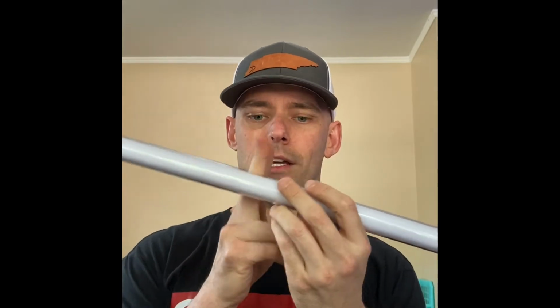It has the WS2812B strips in it. I also took the point in the middle where the manufacturer solders them together. I cut those, trimmed them down, and resoldered them so there's no dark spot in the middle whenever it's lit up. Got the blade side adapter to hold the 3-ring connector for the 7-pin hilt side connector from the Custom Saber Shop on here. The bottom of it looks a little rough because the saber originally had a fixed blade.